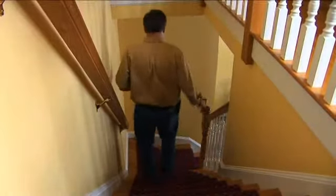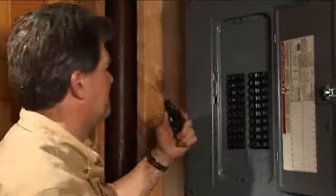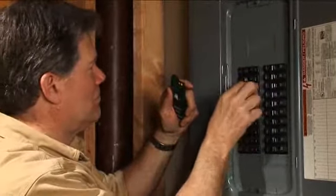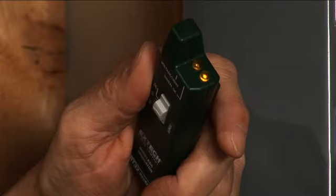Go down to the circuit breaker panel. Be sure that the yellow signal OK LED is ON and stays ON when you reach the breaker box. Sequentially switch breakers ON and OFF. Once power to the circuit or cable which the transmitter is clamped onto is interrupted, the tone alert will stop and the amber LED will go OFF, thereby identifying the cable.